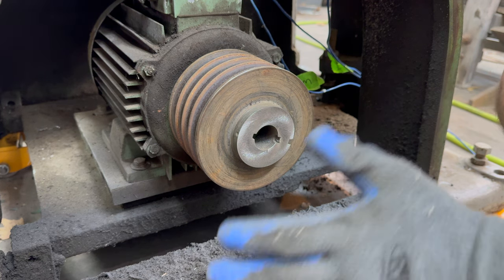A trick I picked up along the way was to use the vacuum for paint stripping. In this way, I would use my solvents to make the paint into a gel, and instead of burning through endless rolls of paper towels, I would use the shop vac to suck up that paint chemical slurry. It worked really well, it sped things up and kept things fairly clean. The only downside is eventually the vacuum hose got really heavy. I never actually clogged it, but all those ribs got filled with paint slurry. At the end of this project, that vacuum hose was pretty much shot. So I'm not sure if I really saved any money in paper towels, but it made it go a little bit quicker and it didn't suck quite as much.